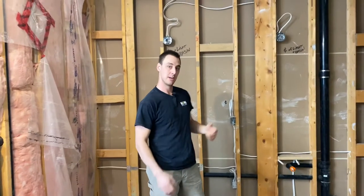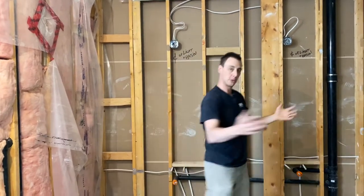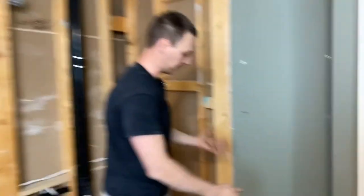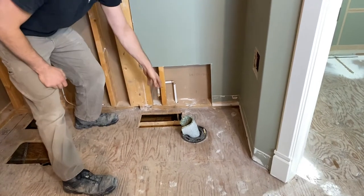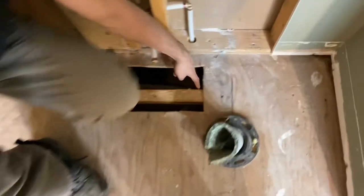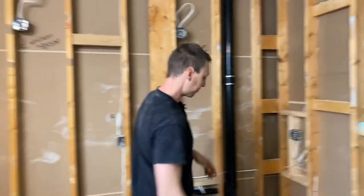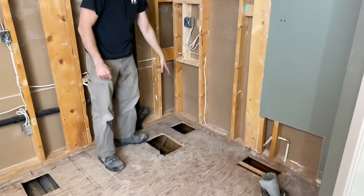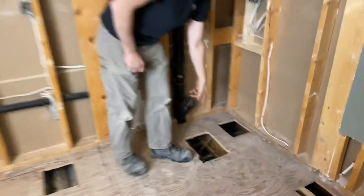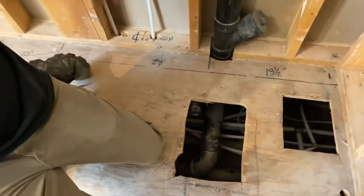This is a master bathroom reno. We've got a toilet over here — it stayed, we didn't do anything except remove the water line. The specs were very specific on where the water line had to be, so it was coming out of the floor before. I cut open a hole, brought it up, and it had to be 11 and 3/8 inches to the left of center and six inches off the floor. There actually used to be a shower here — we got rid of the valve, cut and capped the lines, and put a permanent cap on the drain.